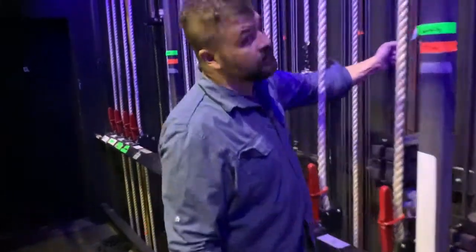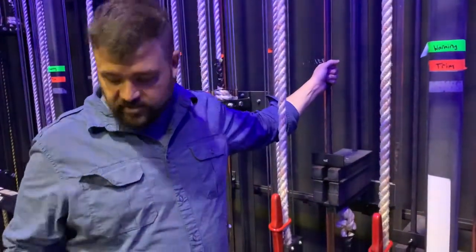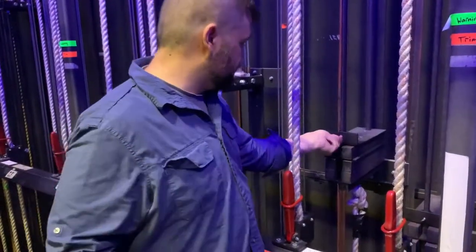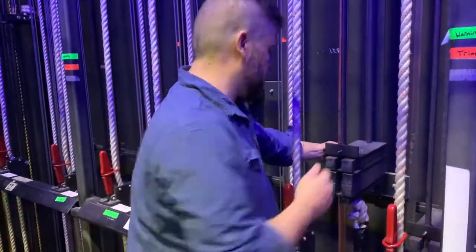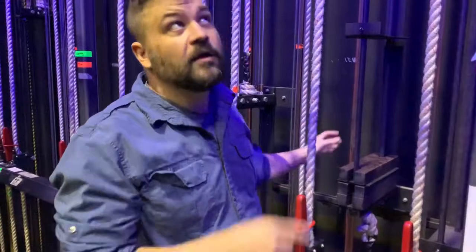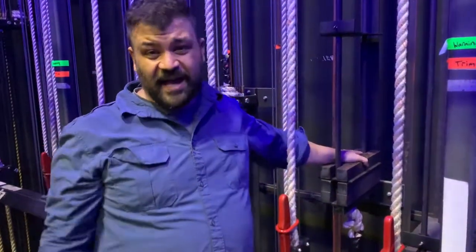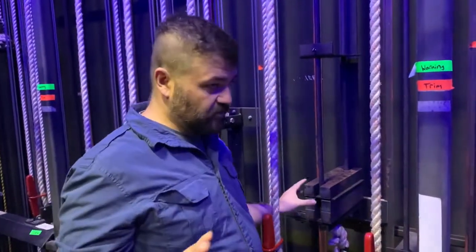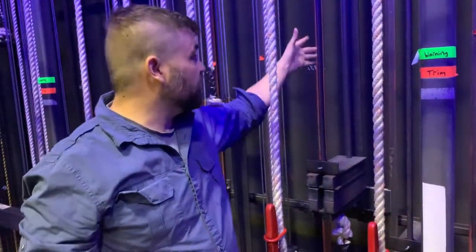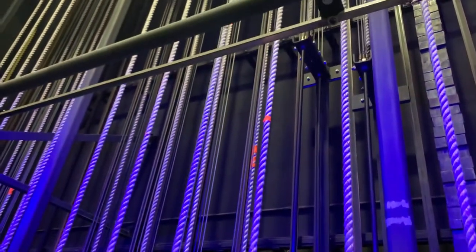This wonderful device is called the arbor. The arbor holds the weight — we've talked about those 22-pound weights. The biggest thing about these is that they have to be balanced. I can loosen this pin just a little bit — if I was going to change the weight on this and it wasn't in weight, I can then lift this up and lock it down, and then you end up in a spot where you can load weight. We'll talk more about that when we get up there. These are called weights — you hear them called pig irons — but they're counterweights, and they're different weights. The whole device is called the arbor, and then you have these spreader plates right here.